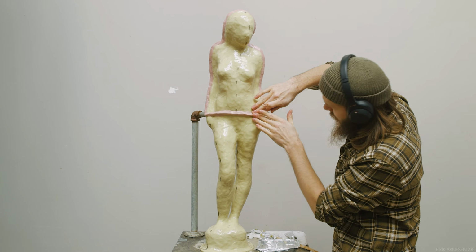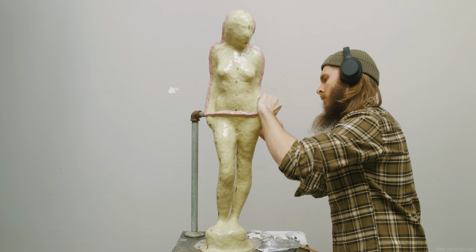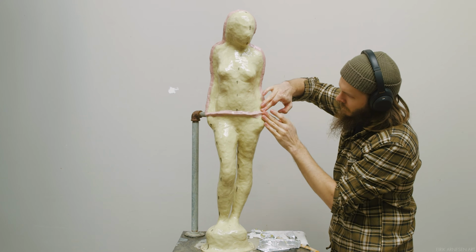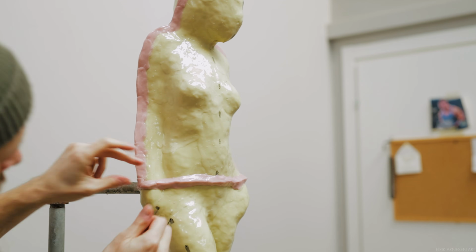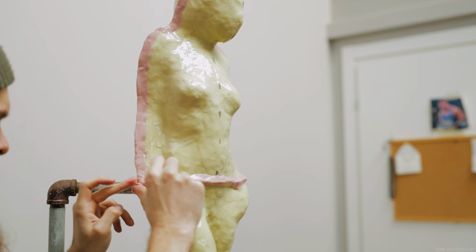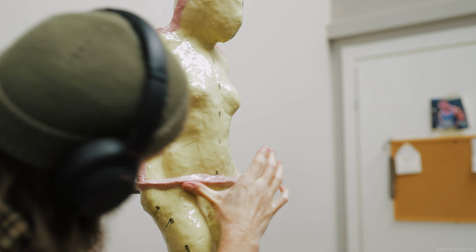For the first pass, I'm interested in building up a triangle-shaped preform that I can expand upon in later passes. The size of this triangle is a bit based on taste and experience. I know and can kind of feel how much I can get away with while building this wall before it begins to sag. And if it sags, it can compromise the placement of my wall, of course, because the wall will move, and it will also slow down the curing process because the silicone is moving, which means I must wait longer for the next pass.